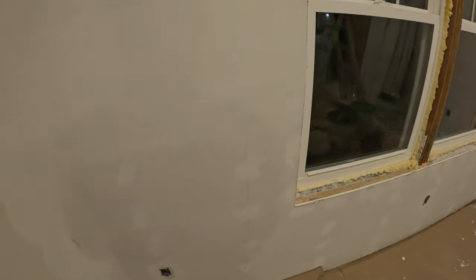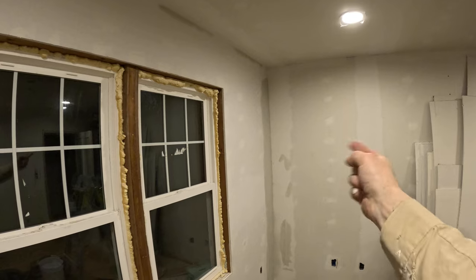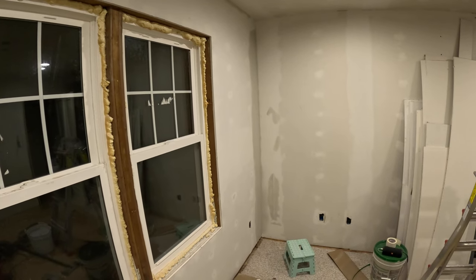Okay, I've just finished off slapping another coat of mud on everything that needed it — and when I say coat, I really should just say we went around and spotted everything that I thought needed it. I did most of the screw holes — most of those seemed like they needed an extra coat. Then just went around the corners and sides, wherever needed it. You can see where it's still wet. Most of this has actually dried already because we're putting such a thin coat on, but you can see where we got it a little bit heavier — it is still wet yet.